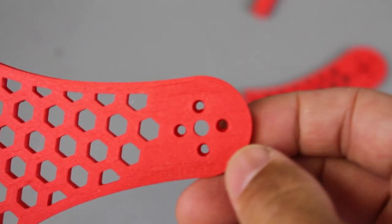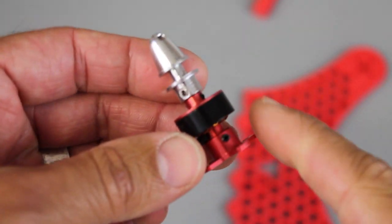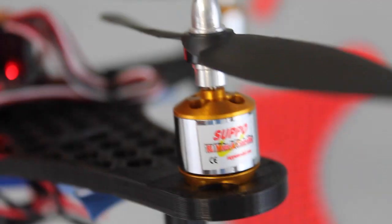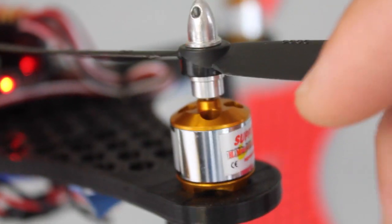The other really important thing I wanted to do to make this build dead simple — if you've seen my previous builds you'll notice that I've used either these Turnigy or these iPower motors. The problem with the Turnigy is that they're 2S motors. The iPower are great little motors but I always had a problem with the mounting holes. But after flying with these Supo A1510s I've definitely settled on these guys.